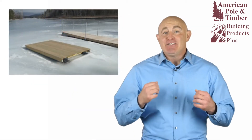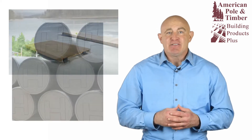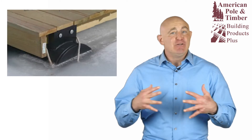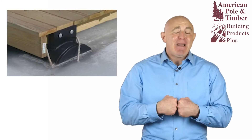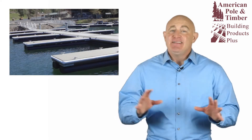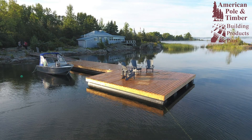When it comes to durability and longevity, Hyland floats are unmatched. Hyland floats are made with half inch thick high density polyethylene, also known as HDPE, and all attachments are fusion welded, which means they are highly protected against impacts, impervious to corrosion, and impenetrable from marine boring organisms. They are also UV resistant and suffer no damage from freeze-thaw cycles. Simply put, they are made to last forever.